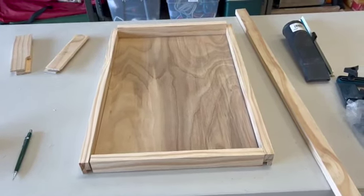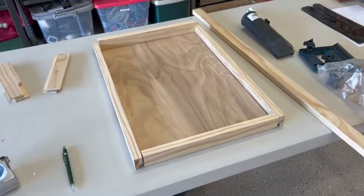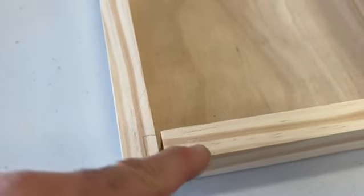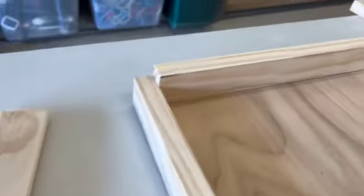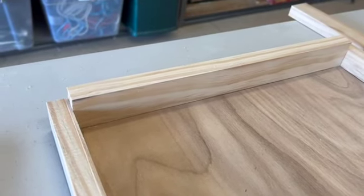So we've got the pieces cut out. We ended up having to re-mill some of the side pieces — I had a little bit of an oops on the router table. So now we just basically got to come in here and fix these corners. We need to put a little rabbet at that location so this piece here will kind of slip into here and close everything up. Right now the end pieces are nice and snug and basically the outside pieces are just sitting on the side of the plywood. I did leave the back end a little high so things don't fall off the back when we pull the drawer out.